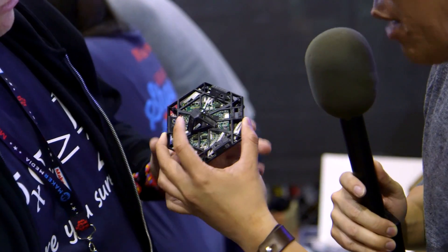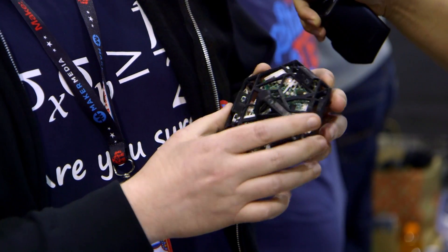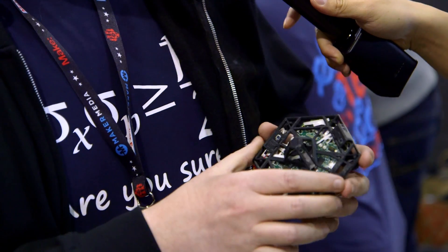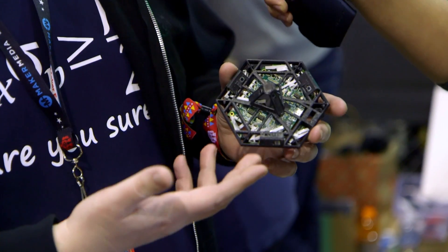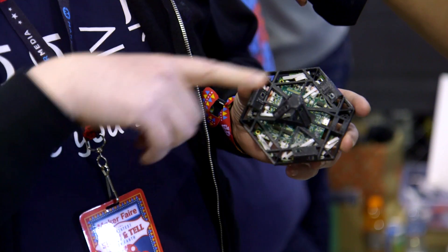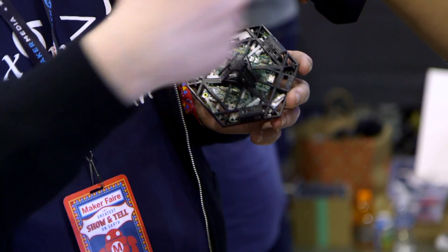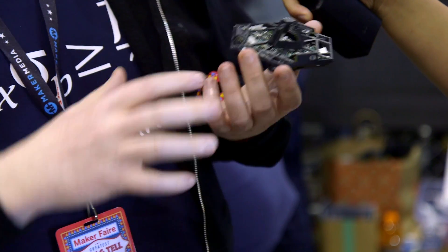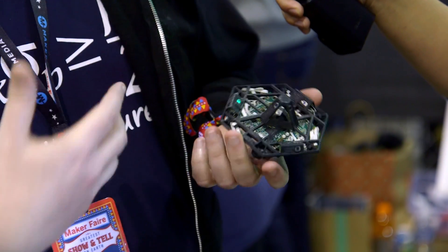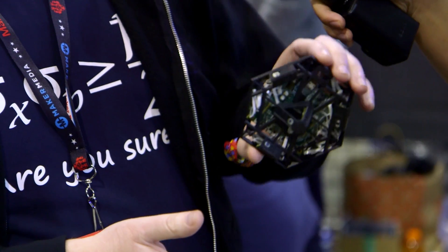In terms of the sensor — what type of sensor is it? For example, this is a prototype of what's going on top of the SteamVR controller, and you have a lot of these sensors. This object has 19 sensors on it. Each one will individually pick up whatever base station signals it can see. From that, you get a bunch of angles that say, okay, from the base station to my sensor, I'm at an azimuth and an elevation relative to that. By knowing the configuration of sensors on this object, we can do a triangulation problem solved to work out not only its position but also its orientation in space.